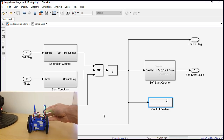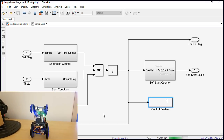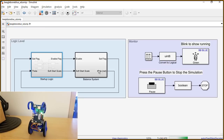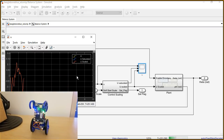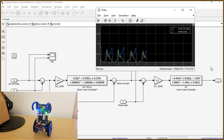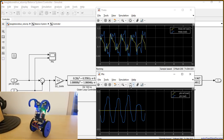I'm just going to pick up the EduMip here. I'm hoping that by the time it's in a good position, the control is going to be enabled at one. And if I let it go, it should start balancing. First it started recovering from the little kick I gave it with my hand, but it's going to be balancing. Now that this control is enabled, we can start looking at some of the results on the scopes. We have the control effort being applied to the motor — that's the U value going to the motors. Then under the control we have the scope for phi, which is the wheel, and then theta — the angle of the actual pendulum. For the EduMip to stay still, we want phi to be zero: it's not moving forward or backwards. Theta is the reference angle that we want to be at so it doesn't fall over.